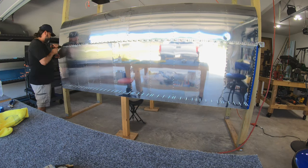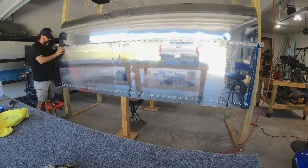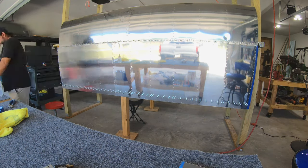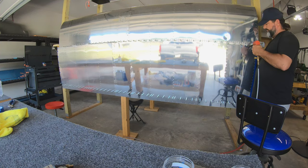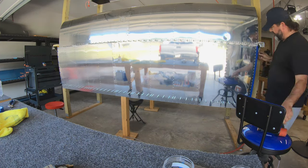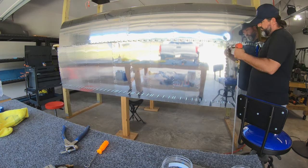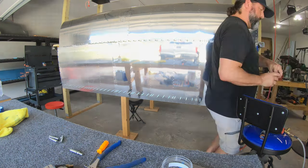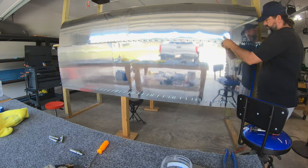Moving on — I swung down to the outboard end of the wing and that was fine. You've got a ton of room there and it's not difficult to locate those rivets. I think I got through one and a half bays — the first bay and halfway through the second bay was about as far as my arm could reach where I felt I could reliably buck those rivets without making a mess. Maybe I drilled one out down there because I got a little trigger happy and smashed a rivet.